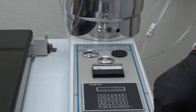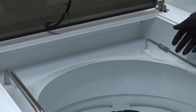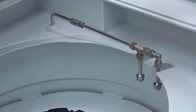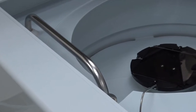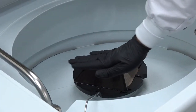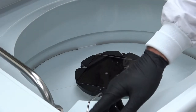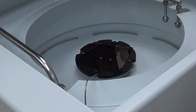We're going to press the lid open button so the hood will now open. Looking into the chamber, here we have the high pressure arm with two spray nozzles, which is really just a single dispense. Here we have the spray arm for the brush scrub — there's a nylon brush on the bottom aligned within a few millimeters of the mask surface. The brush scrub comes across and agitates the surface not by direct contact, but by mixing a solution of DI water and surfactant to create a scrubbing effect. Here we also have the N2 blow off, which blows off the majority of water after cleaning is completed, prior to the heat lamp turning on.